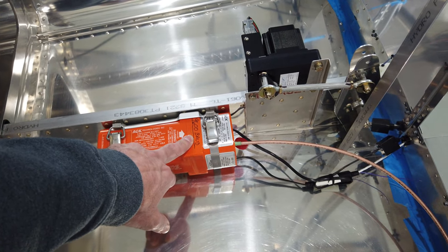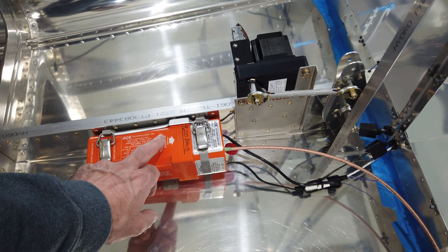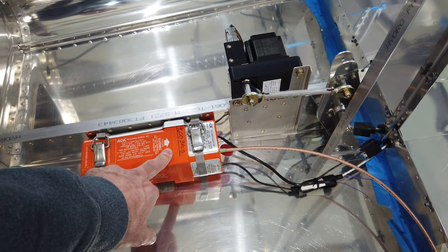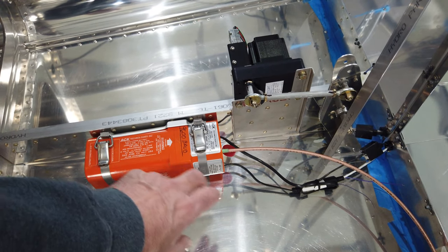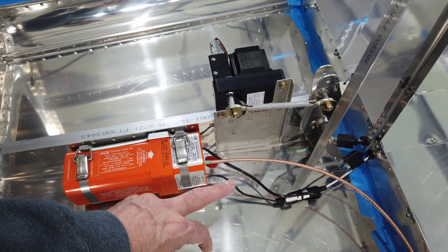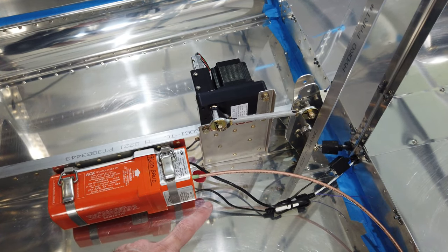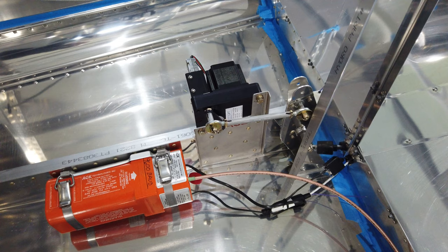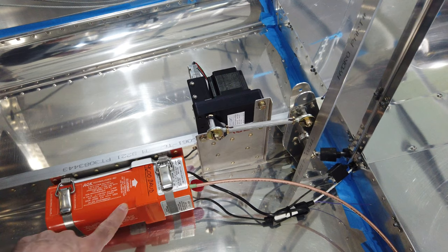I made a note here on the ELT itself. When you look at the instructions for this, you have to set the baud rates for the ELT to match the baud rates of the device that's going to be feeding it the GPS signal. So I did some research and I looked through my stuff and I can't think of what it is now. My GPS, I'm drawing a blank, but it has a port for 9600 baud rate. So I took the ELT apart per the instructions.